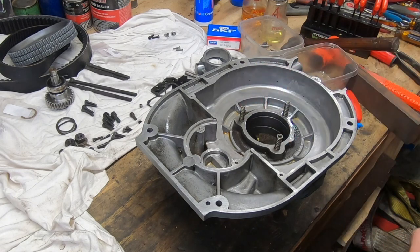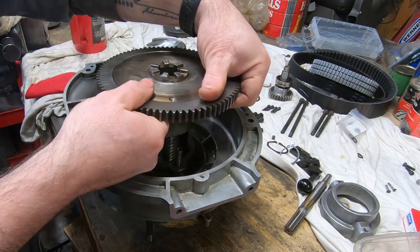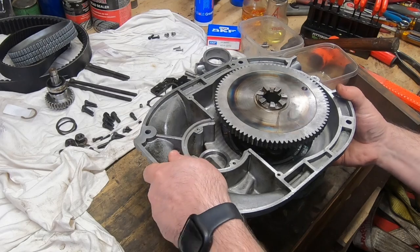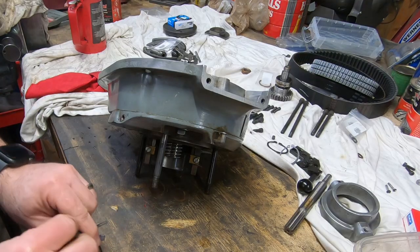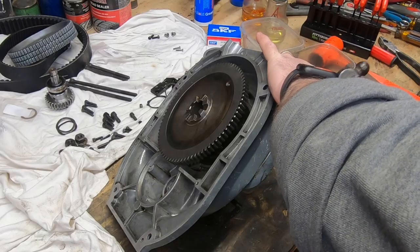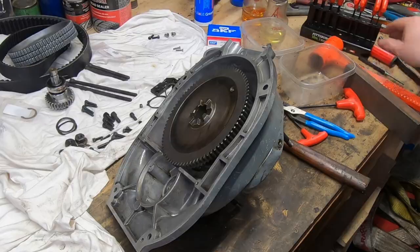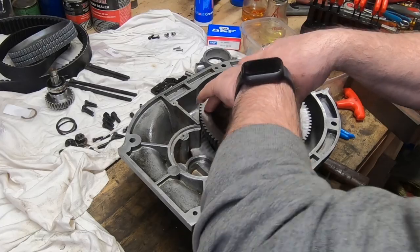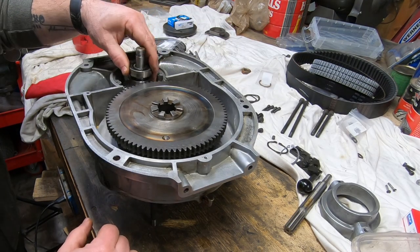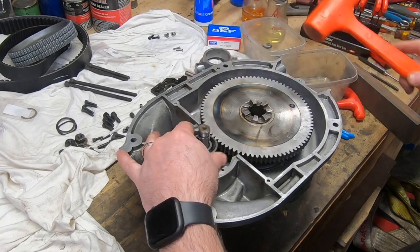Now I can move on to putting together the gear housing. These springs are part of the high gear/low gear mechanism. There's a big washer that goes between those springs and this bull gear. There are a couple of tabs on the gear housing that the bull gear needs to slip past - it's a relatively tight fit, so I'm using a punch to rotate the bull gear around until it falls in and can freely move up and down. Next I'm reinstalling the bull gear pinion assembly, which I did not take apart - I just cleaned it really well.